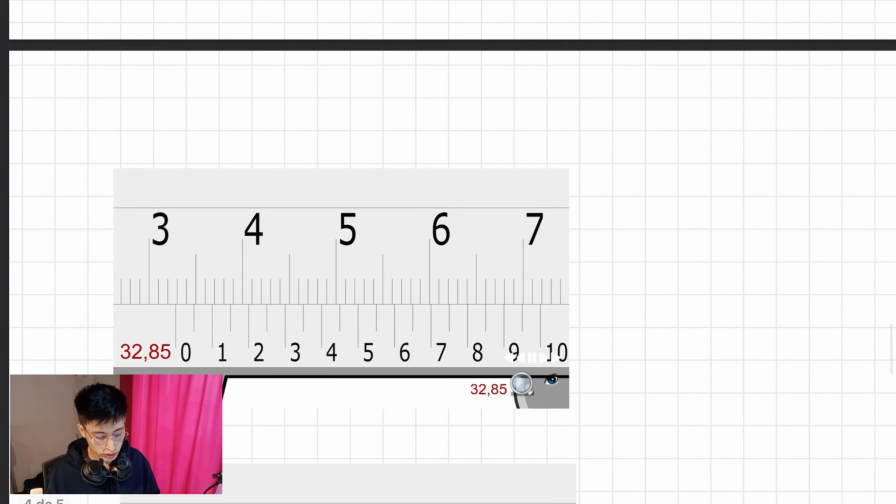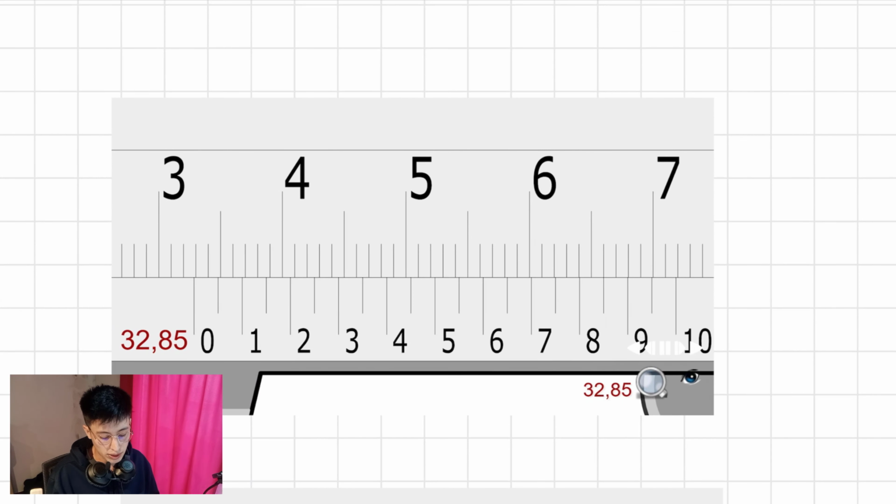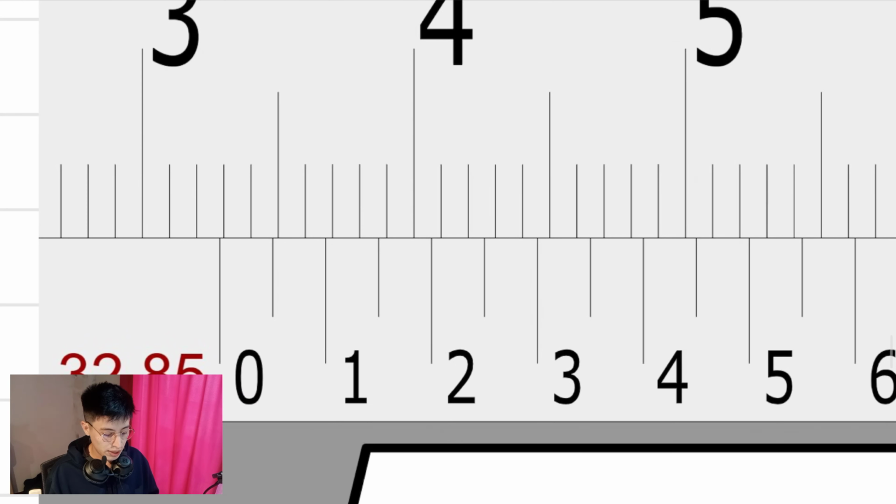Now, we will level up regarding the other scale that we mentioned, that means 1/20. That means that we will divide the vernier scale in two, right? As you can see right here. Now we don't only have the 1 and 0, but there is another one right here.